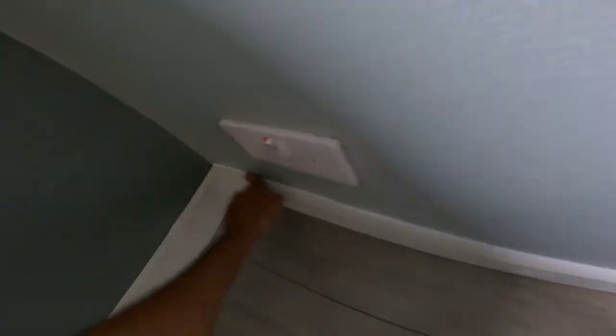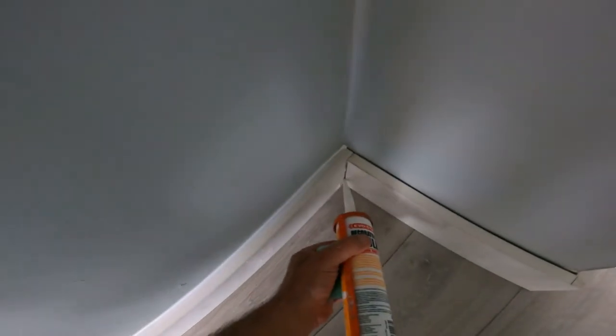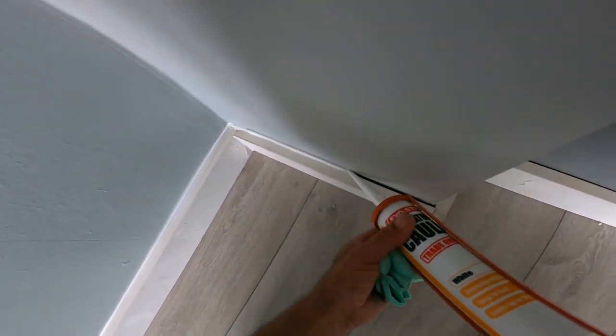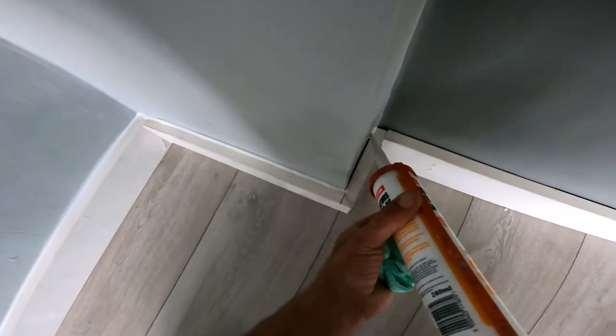Again, just use your finger, take an inch off there. It's already looking pretty good. Just there, that one length there is nearly complete now. Get a bit in that corner. I always do the corners as well, so I'll be striking that through there, like that. While I'm here, I might as well do this one here. There's a bit more of a gap there as well, but I'll just pump a bit more in. The gaps aren't horrendous. I'll do that return.